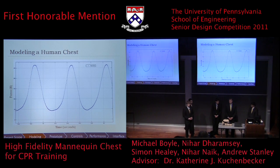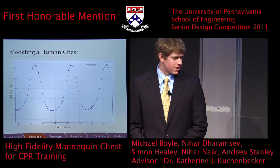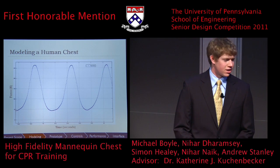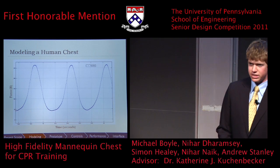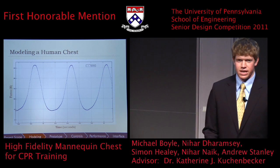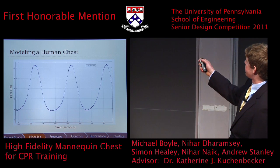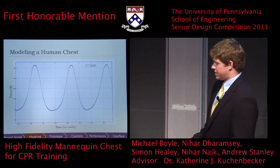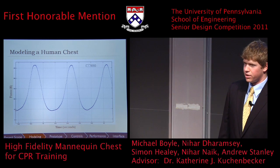To create our dynamic model of the human chest, we analyzed data provided to us by our sponsor at the Children's Hospital of Philadelphia. This data was collected using that same puck tool by a doctor administering real chest compressions on a 21-year-old male patient. This data provides both force versus time and displacement versus time data for the human chest. We had about 60 compressions worth of data to analyze, and we have 3 compressions worth of our force versus time data shown here. So we look at all 60 compressions and look at an average stiffness of the human chest for all these compressions, and it came out to about 8,100 newtons per meter, which we can simulate with a spring.